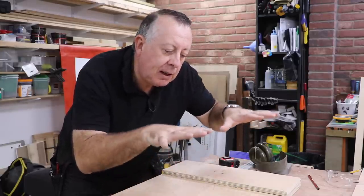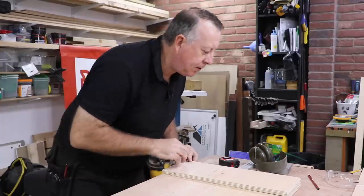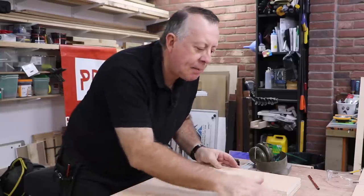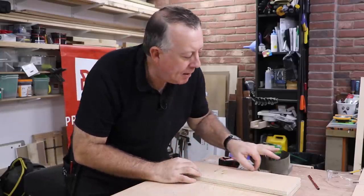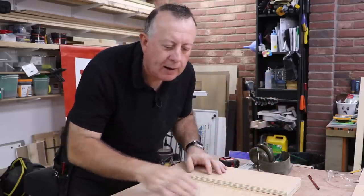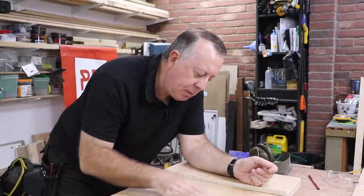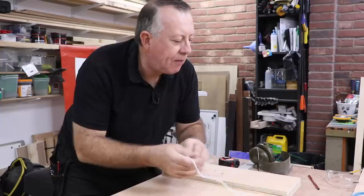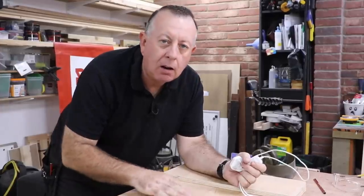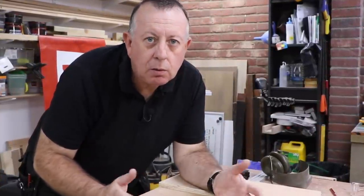I can only have two, and I need them full on the top so that it's nice and flat. But what I can do is, with the strips that I've got left over, I can laminate, glue and screw around the perimeter. I've already cut this 10mm too big, so once that's laminated on and it's gone off, I can trim 10mm from the perimeter through both sheets of ply, which will give me a nice flat surface to finish off with. The back two faces aren't so important because they are against the wall, so you're never going to see those. And ironically, that gives me a void around this area, which gives me more flexibility to put this in and play around with the wires and the lengths of the wires. Rather than routing it out, I've just ended up naturally with a void. So, because I've got a lack of ply, that's what I'm gonna have to do.